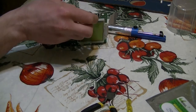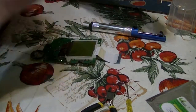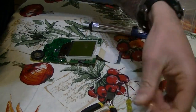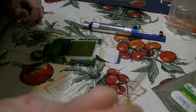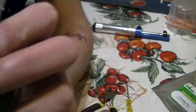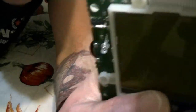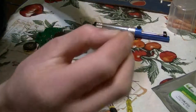Alright, so there's the red diode — we don't need this anymore. Now when you're putting your new diodes in, make sure it's a three millimeter two-prong one like this. The top part, which is the positive part, goes at the top — it goes in here like this. I already have one cut — it's this one right there, so I'm just going to use this one.